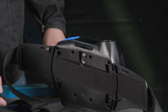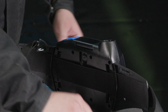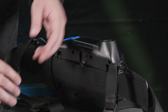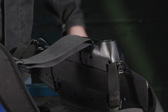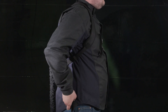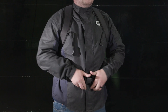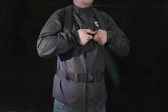Proper fit of your PAPR blower will maximize comfort for all-day wear. First, hook the backpack-style shoulder straps up to the blower assembly belt pad. Then place the blower assembly against your lower back and slide the shoulder straps over your shoulders. Fasten the belt around your waist and adjust the straps and belt to a snug but comfortable fit.